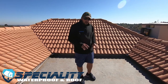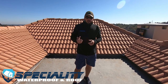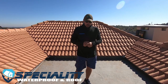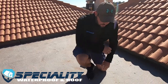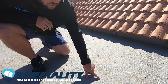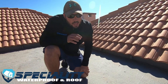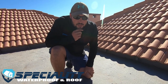This concrete surface was previously coated with an eco-friendly liquid rubber system and it has failed after just six months. We've seen this applied to flat roof surfaces quite a bit and we repair this on basically a weekly occurrence. If you have a look at the substrate here, you can see the rubber system is already bubbling — if I press my nail into it, you can see it's bubbling as far as the eye can see. The structure is allowing water to seep through and it's destroying the surface on the inside.